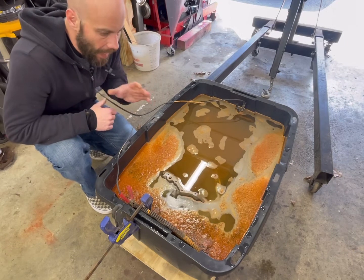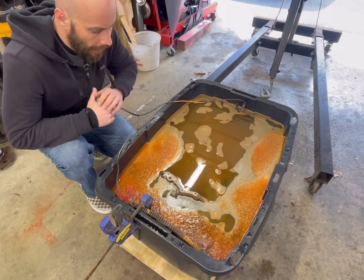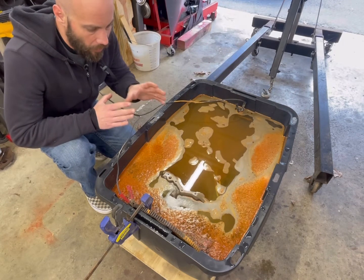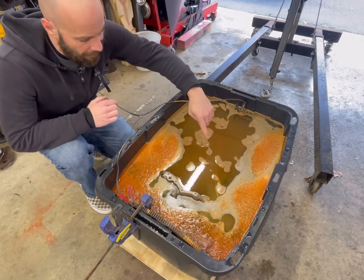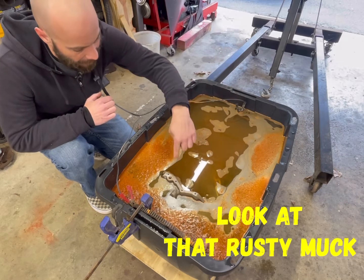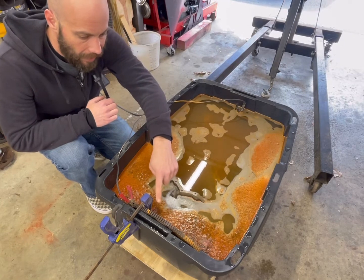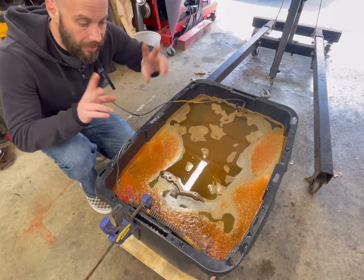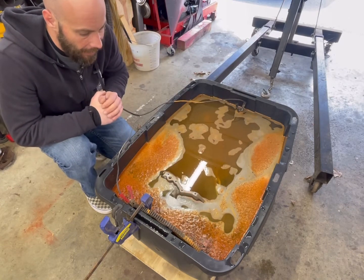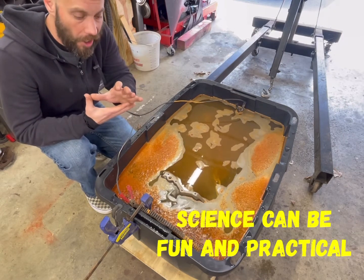I'm back. It's only actually been about an hour and a half. Look at all this rust and this sludge — that is being pulled through in the electrolysis process. When you watch this in time lapse, you can see everything flowing. That's actually the current being produced by this process. You can see the clean bubbly water being pulled this way, and all the contaminants from this block are being pulled to that sacrificial plate — it's acting almost like a magnet because it is the positive charge. All that gets contained there, and when you pull it off, you'll see all that rust and junk attached to it.